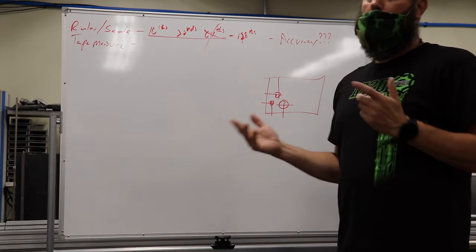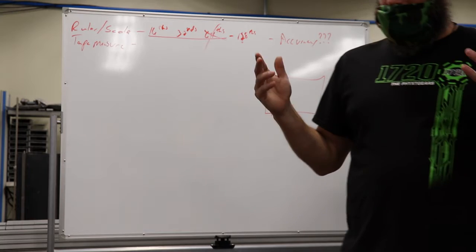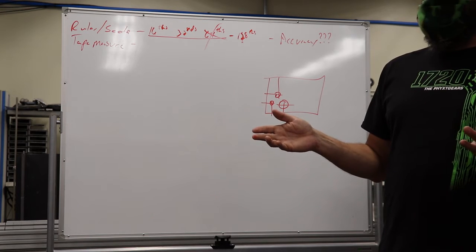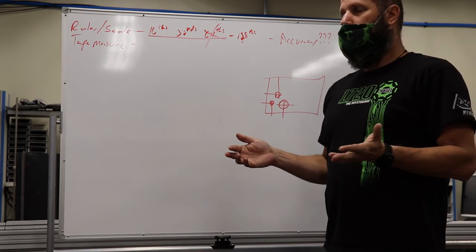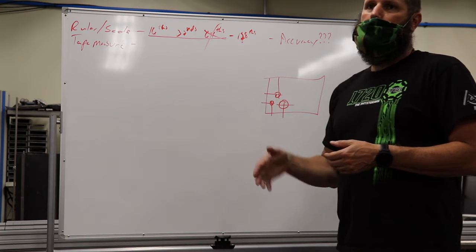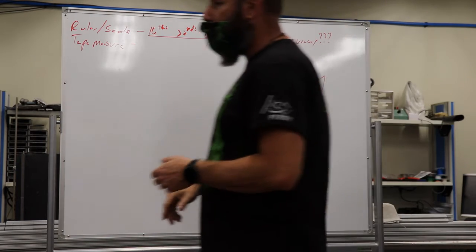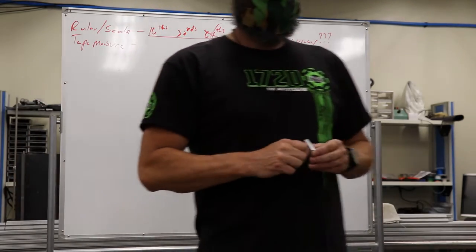And so if you lay a part out, when you go to machine it, it gives you a second shot to say, oh wait, if it's not lining up with where you thought it should be, then you either messed up at the beginning when you laid it out, or you're making an error now. And so by laying a part out physically, number one, it helps you map out that geometry in your head. And then when it comes time to actually machine the piece, it gives you a second bite at the apple to make sure that you don't mess it up.